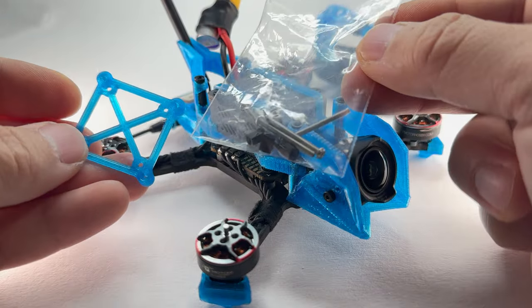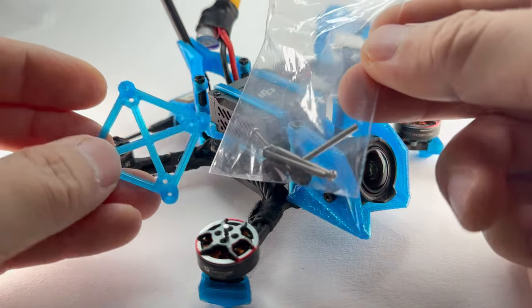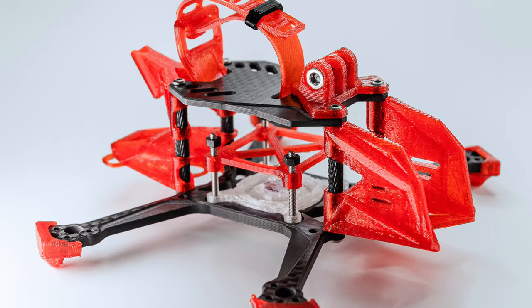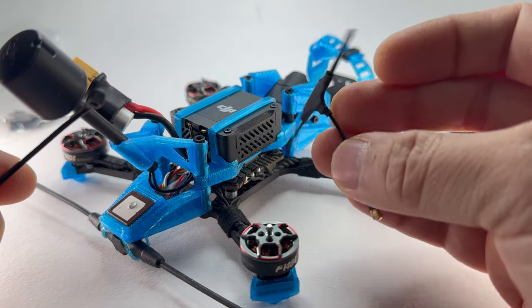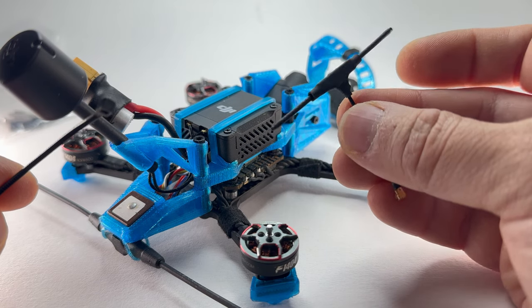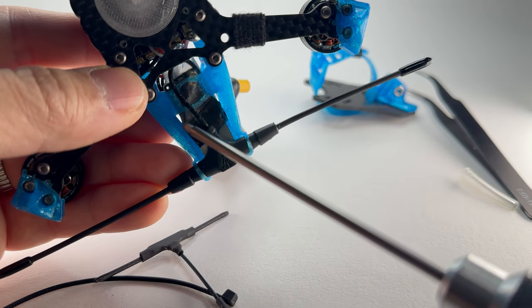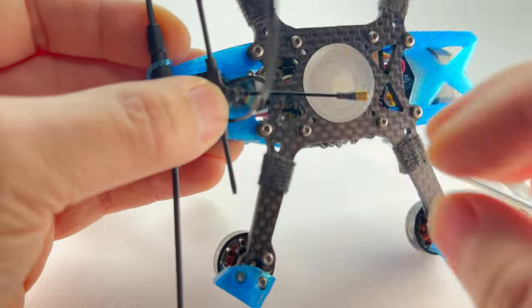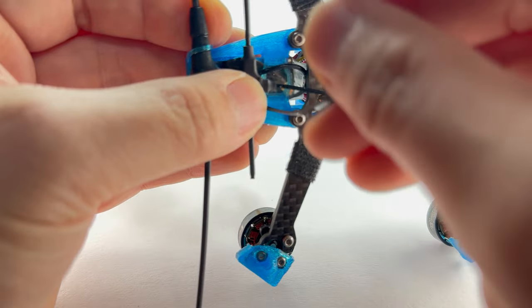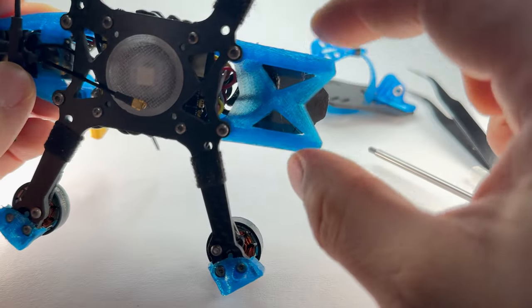I've included a few items for people who don't use the DJI O3 AU — depending on whether you're using an AIO or mini stack, you can use a combination of these things to get a nice stack. The kit also includes two zip ties to clean up your build. One notable feature: if you plan to use a smaller RX antenna, it probably won't fit using the slings. So to use a zip tie, you see the two holes here — you can mount your mini RX antenna using the zip tie, and you can also mount it up front.